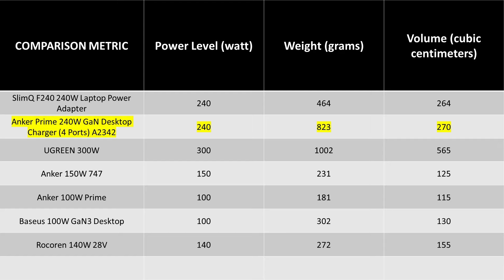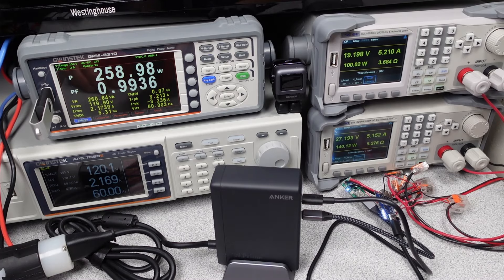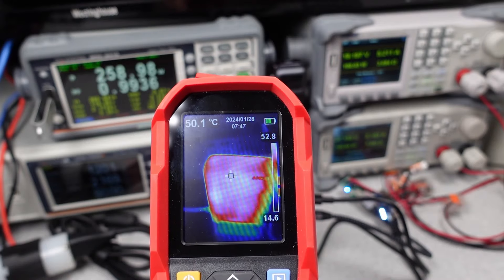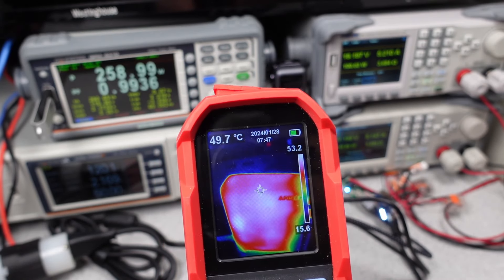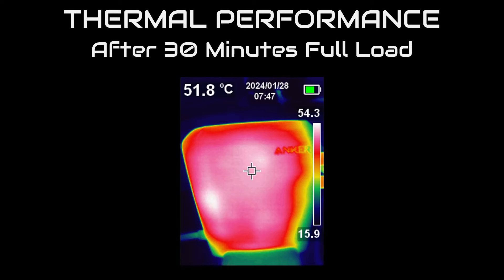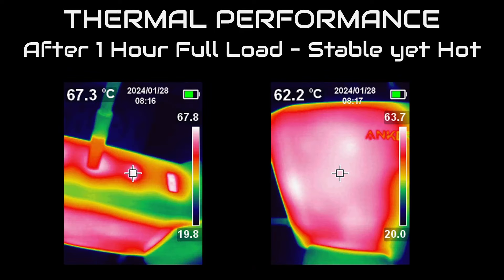Next, I look at the thermal performance of this charger. It is always the part that gets me worried that something is going to blow up, because these get hot. Let's face it — you want it smaller? That means they get hotter. In this case, after half an hour, things look more or less reasonable — mid 50s degrees Celsius. After an hour or even longer, as it turns out, it achieves thermal equilibrium and sits around 65 degrees C. This is hot. I actually got a mild burn after the test because I didn't hot potato enough, but it's within the safety limits. The fact is that it didn't shut down, and post one hour, it didn't continue to get even hotter — which was a positive result.